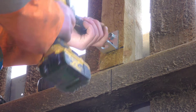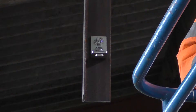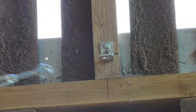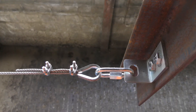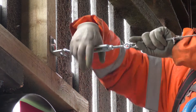The fan and tube height document confirms the distance from the fan centre to the mounting brackets. Fix the mounting bracket at the non-fan end at the same height. Attach the thimble and turnbuckle to the 4mm wire with the rope grips. Attach the turnbuckle to the mounting bracket and run the cable to the opposite mounting bracket. Fix to the bracket and tension. Adjust the cable to run vertically above the tube.